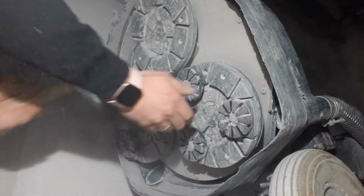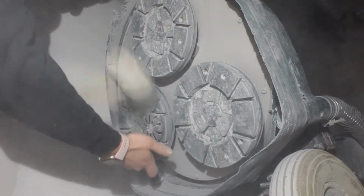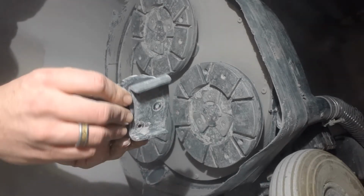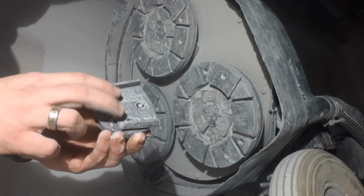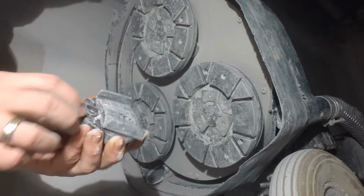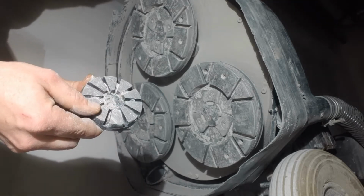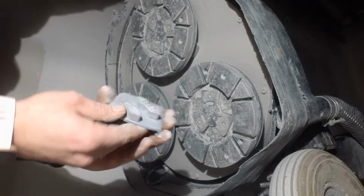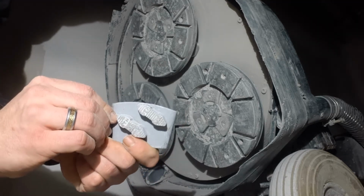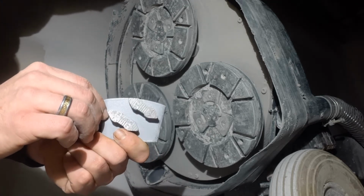Hold your breath, boys. It's a bit dusty. So these are a little invention that we created. This is an HTC plate, or like a diamond, that was worn down, that had holes. We drilled holes in it to adapt to the SACE diamonds. So these are our 3040s, and we're gonna put on our CX3s. These are for hard concrete. It's HTC's X series. So we're gonna slap these on and get some cutting done, yeah?